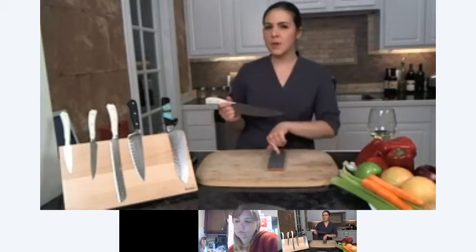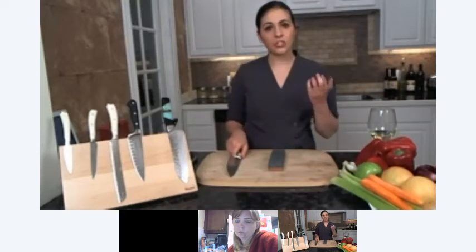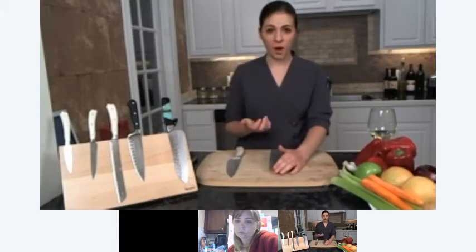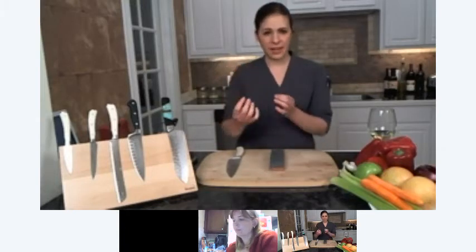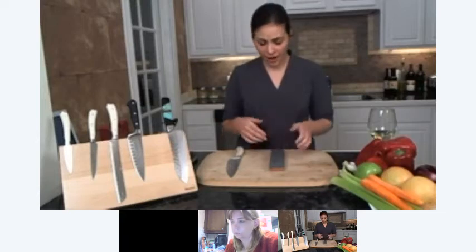Now, whetstone is spelled W-H-E-T-S-T-O-N-E, whetstone, and whet meaning to sharpen or sharp, not W-E-T. There are some stones that people use that are water stones, but typically a whetstone does not need to be oiled or watered. That oil or that water can kind of trap in loose metal particles and can tear up your knife a little bit more than you were intending. Some people still love to use oil, and that's fine if that's your preference, but plenty of whetstones are fine used dry.